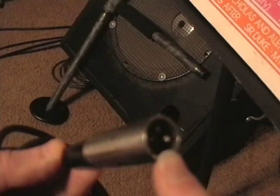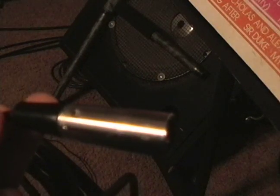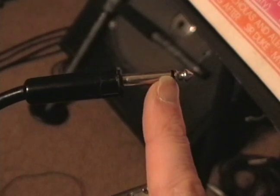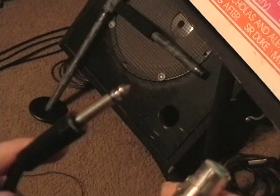What I did is I built an adapter to connect it to the reel-to-reel machine, because the cheaper, low-end consumer model reel-to-reels — four tracks — do not have the expensive XLR balanced connections like these. This is that connection there. As you can see, I actually wired up a connector here myself, bought these at a popular electronics store. This is a mono plug here — you can tell by this particular separator, this insulator. When you have two of them, you have stereo. This wires up from here to here, so now we can connect our microphone into the reel-to-reel deck.